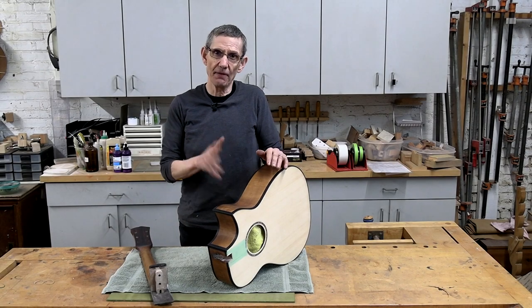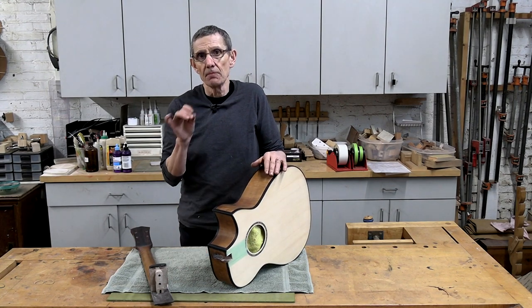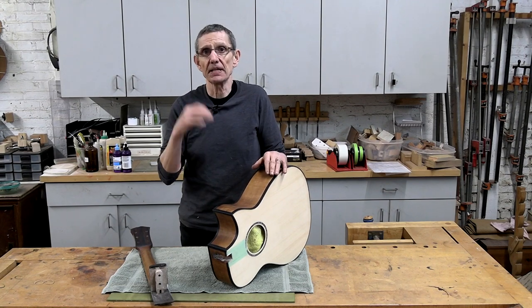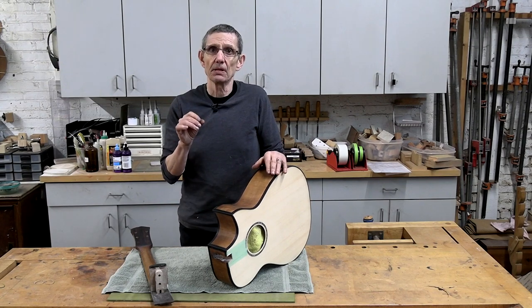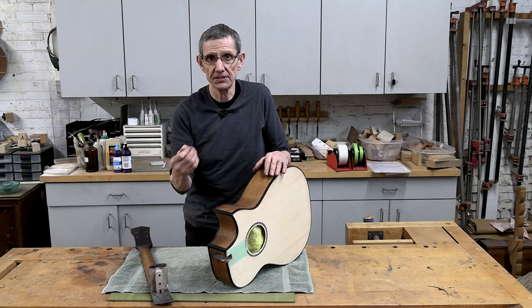We're now ready to buff out the guitar body and the neck after wet sanding up to P5000 grit. But before we get into the buffing, I want to make some introductory comments about buffing and what we did prior in general. One of the reasons that we wet sanded up to P5000 grit was to make buffing go easier.